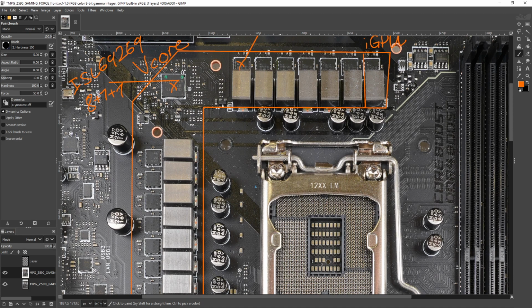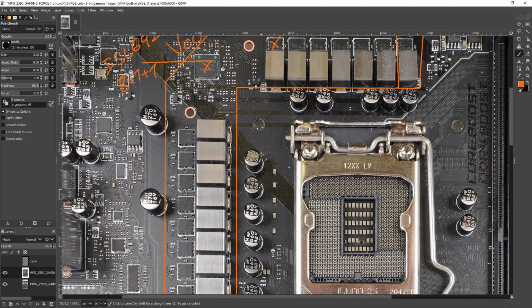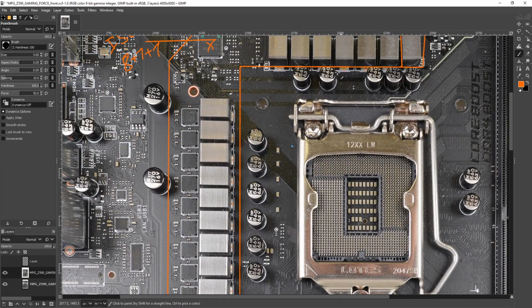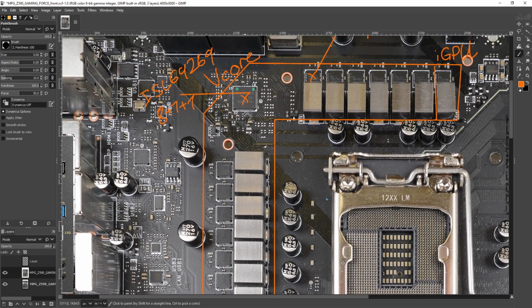With the exception of one motherboard on Z370 that was hitting, I believe, like 1.7 volts or something on load release, which was like, oh yeah, that's probably bad. But this was doing great. A very similar VRM configuration from MSI, not this specific VRM, was doing great, so I see no reason to be concerned by what MSI has done here.